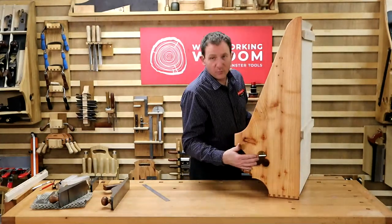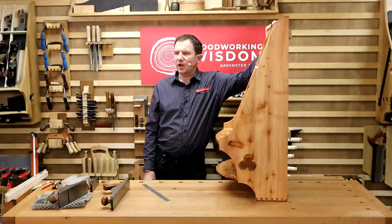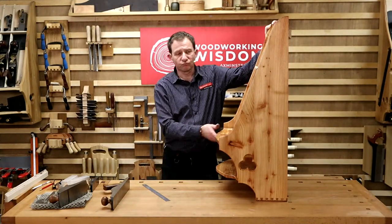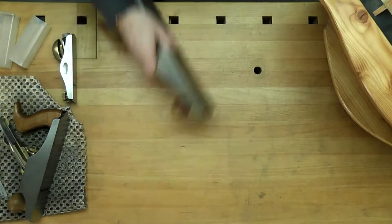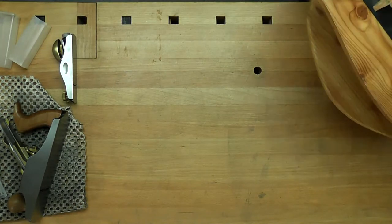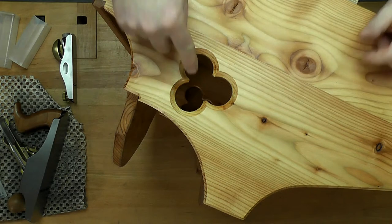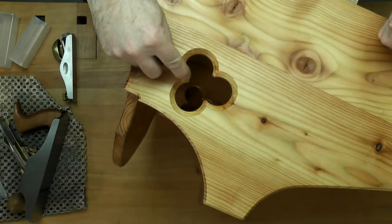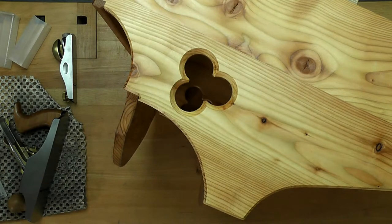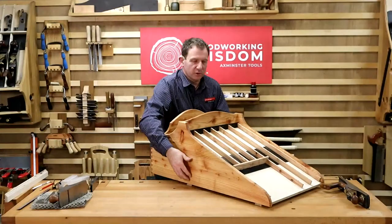I've got my three holes — nobody's asked about the holes yet! I love this thing. Very gothic looking, arts and crafts. The way to do this is so simple: drill three holes that overlap. You'll probably need a pillar drill or drill guide to get them nice and straight. After that, chamfer out the front edge with a bearing-guided cutter. It looks so good when it's up on the wall — very arts and crafts, gothic-y, like a church pew. I've had a few people ask if they can come in for a sermon on Sunday morning.